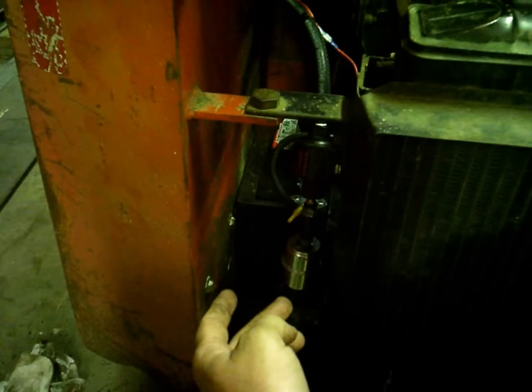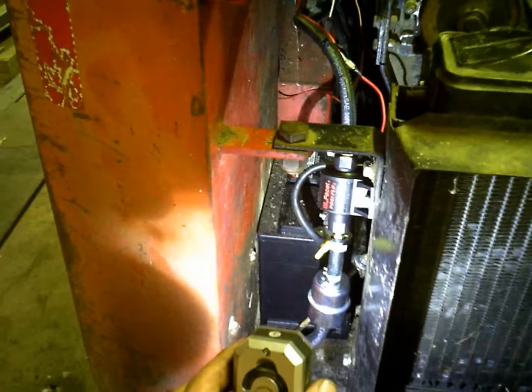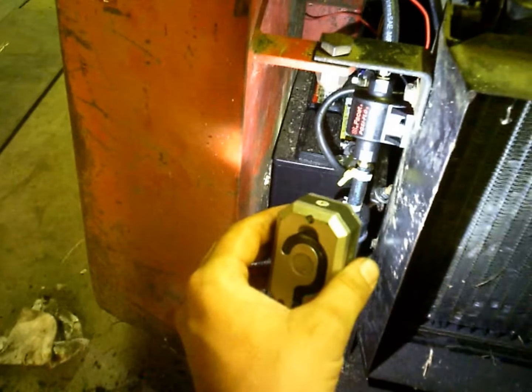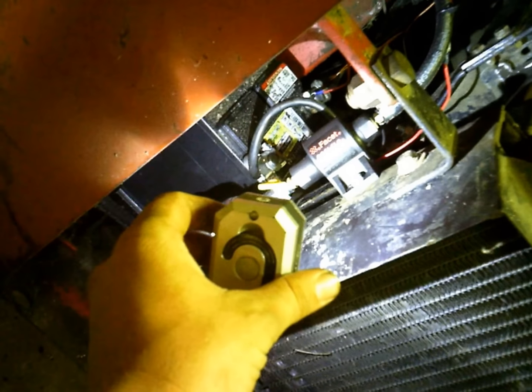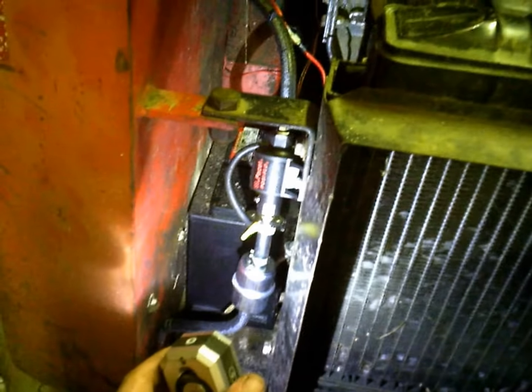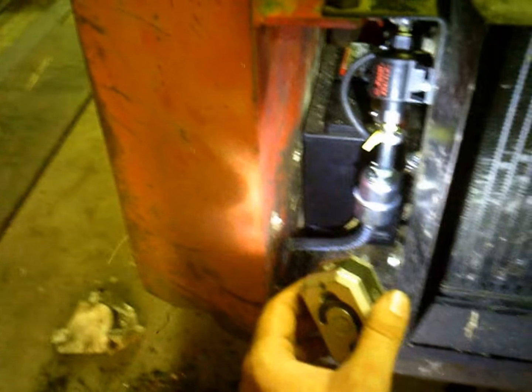For the fuel pump, the NAPA one — I wonder if NAPA didn't end up being right. These engines are kind of hard to get parts for because they're little industrial ones with stuff different on them than cars. So I ended up going with just a universal electric pump. We've got four or five of these on various pieces of equipment around the farm — they work really good and they last a long time. It's called a Posi-Flow. This is a four to seven PSI; they also make a one to four PSI. Really easy to put on, really durable. They make a loud clicking noise when they run out of fuel, which is kind of nice.